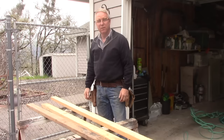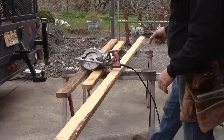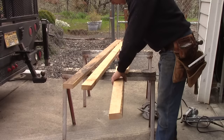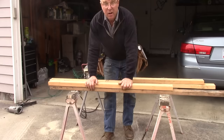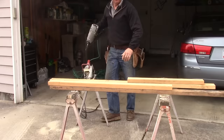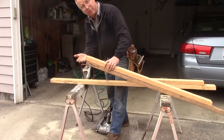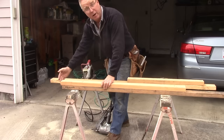To do this, I'm going to cut three pieces. Two of them will add up to 84.75 inches. I want to keep track of these two, so I'm going to make sure they stay in contact. I let the bottom piece of the two pieces that add up to my net height extend below the arbitrary length piece, perhaps an inch. This reduces the net increase in length that happens across the hypotenuse of a triangle, but it leaves the square end at the net distance.